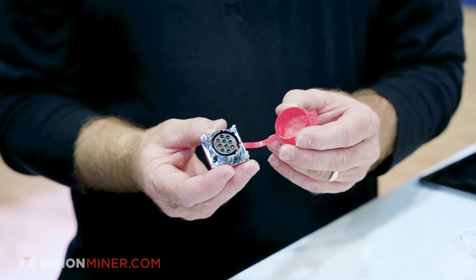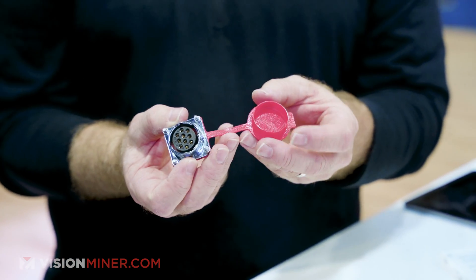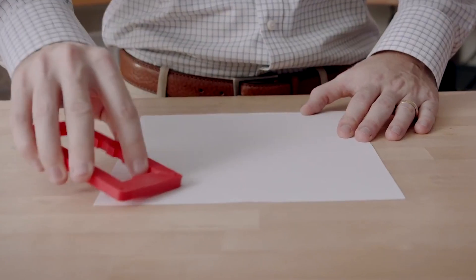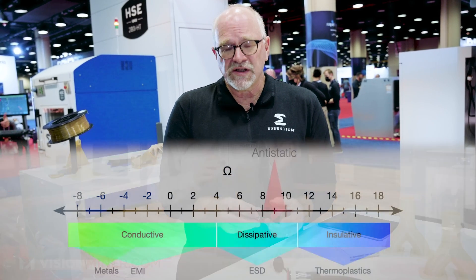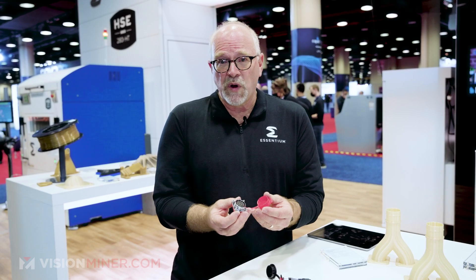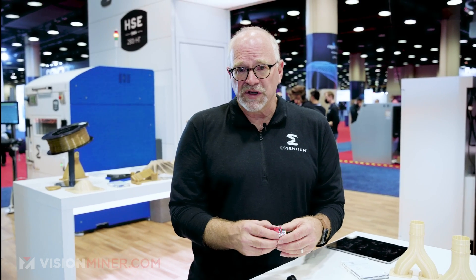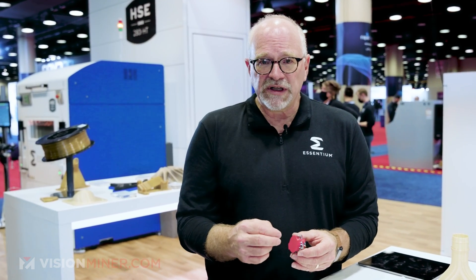This is an interesting material — it's an ESD safe soft TPU and it's red. So we can make ESD materials in colors other than black. This ESD safe material also does not leave conductive debris; if you rub this against a piece of paper, it's totally clean — it does not leave a conductive dust like some other ESD materials in the industry. This is used for a couple of aerospace applications as throw-away ESD safe caps and covers for electronics going into space — an application that was really hard to solve because of the customized nature, the small volume, and the need for ESD safe materials for electronics assembly for satellites.